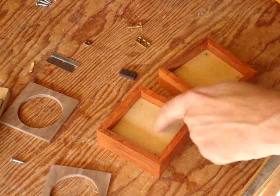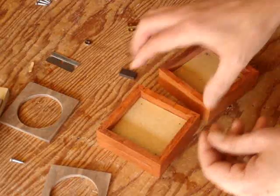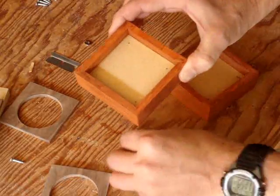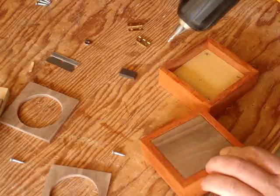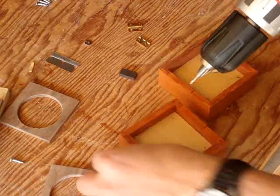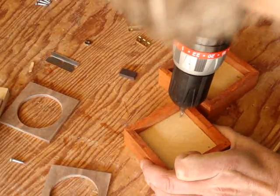For the inside for them to stick to, I'm just going to use half-inch screws. The only trick here is I've already marked where I want to drill the holes, but I want to make sure that when I drill these holes I don't go all the way through the backing, because that would be awful. So I've set the drill bit at exactly the depth I need it, and I should be able to pound four of these in.